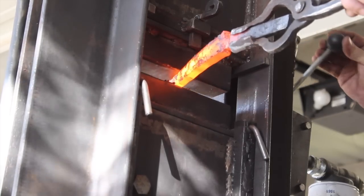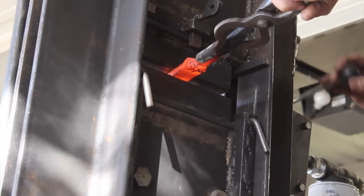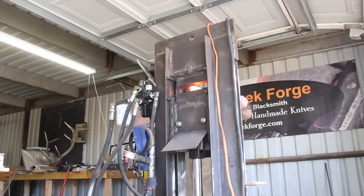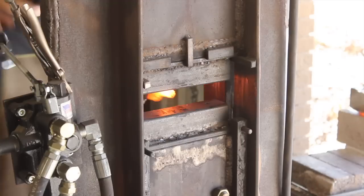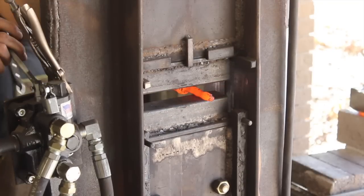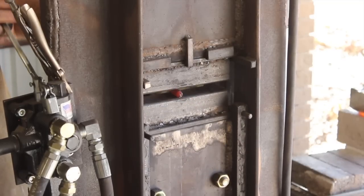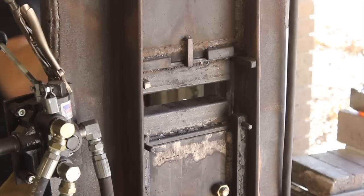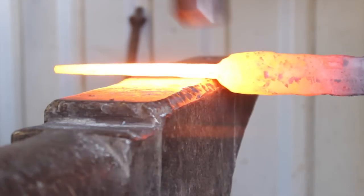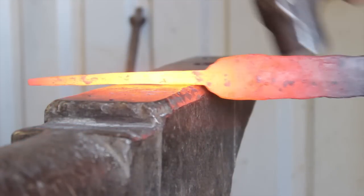The original dimensions were three half-inch square bars that were four and a quarter inches long, and that produced a ten and a quarter inch blade plus the tang. Working the taper in and then the tang. The typical Arkansas toothpick design has a stick tang and usually a rounded handle, so I'm doing the stick tang like so. I'm not sure exactly what I'm doing on the handle yet. Just getting everything flattened down, taper on the tang, and forging down the corners so there are no sharp angles.